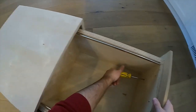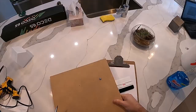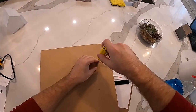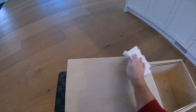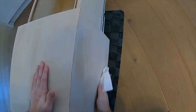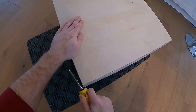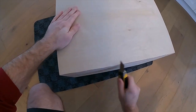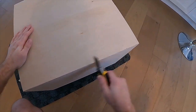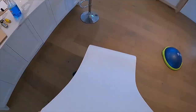We're going to be vinyl wrapping this thing today so it looks better for photos. That means taking the handle off, taking the drawer out, getting everything cleaned up. Compared to painting, the amount of effort to get this thing ready for paint just doesn't sound fun at all. Vinyl wrap is great because it's fast and easy to apply. Its biggest downside is it will show any dust or imperfections in the surface - there's nothing you can do about that after it's applied. I also wanted to round over the two top corners a little bit, as sharp corners aren't great for things sticking to them.